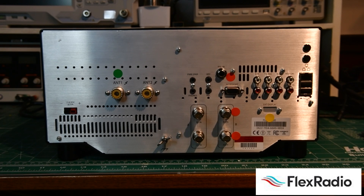Those are just some of the hardware features of the 6400 and the 6600. Key points to remember: does the radio have one spectral capture unit or two? If you only have one antenna, the 6400 is a perfect candidate. If you're a contester building a big antenna farm, two spectral capture units is an incredibly efficient way to build out your station — especially for SO2R operation or MultiFlex work sharing your radio with others. Also consider how many slices you'll use: many people use one or two, while digital contest operators can use up to four. Thanks for listening. Have a great day — Mike, VA3MW from Flex Radio.